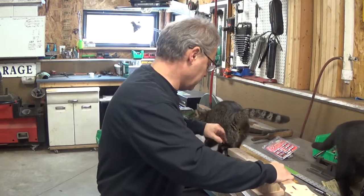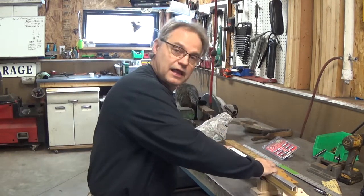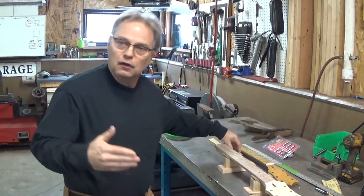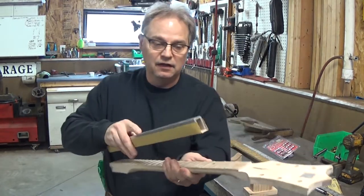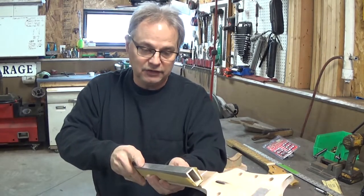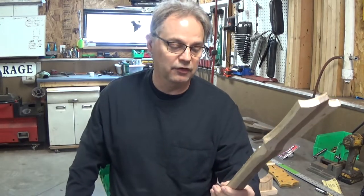As you're working it across, feel for anything catching on the ends, because that indicates a high fret. When you're sanding like that, make sure you keep moving and follow the arch of the neck. Don't just sit in one spot and sand away — if you do that, you're going to lose your radius and have a flat spot in your fret. Make sure you're working it across the neck side to side so it all blends together.